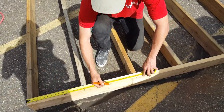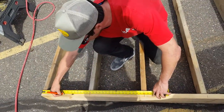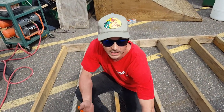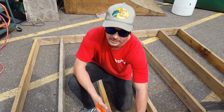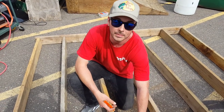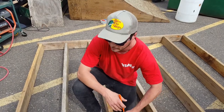A more common number would be 12 inches on center, or you can also do 8 inches on center. So either framing at 8 inch, 12 inch, or 16 inches on center — you pick. Really it depends on how much impact that zone is getting. High impact: 8 inches all day. Really low impact like a deck: 16 inches — you get away with it and save some money in the long run.